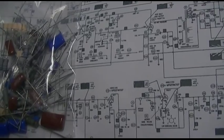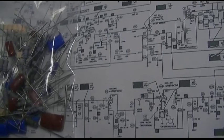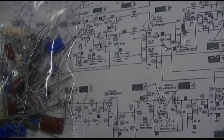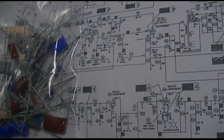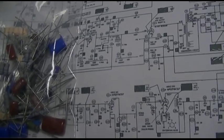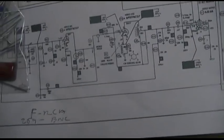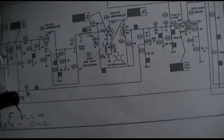So I think it's some kind of false information from some kind of ground loop or the scope not liking 450 volts DC applied to the input or something. So this is still a project in the works. I did find a couple bad capacitors. One of these, actually, they're kind of lossy, and I haven't tried it since.